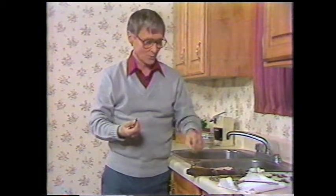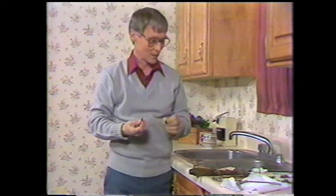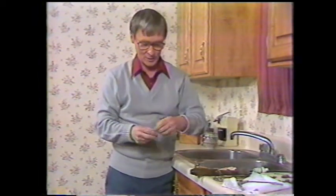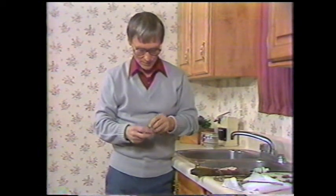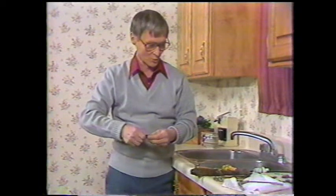Now there are two basic types of washers available. There's a flat washer, which this one is, and there's a shouldered washer, like that. And I think you can see the shoulder on this one. Be sure to use the proper washer. This is a flat one that we're using on this cartridge. And this looks like the right size. Got it the first time. Put the bolt back in place, and you'll probably be able to thread it in by hand most of the way.